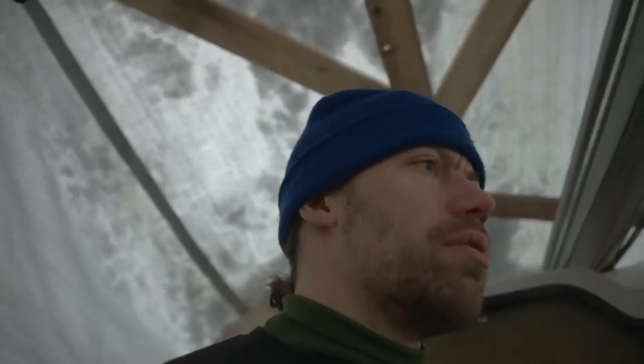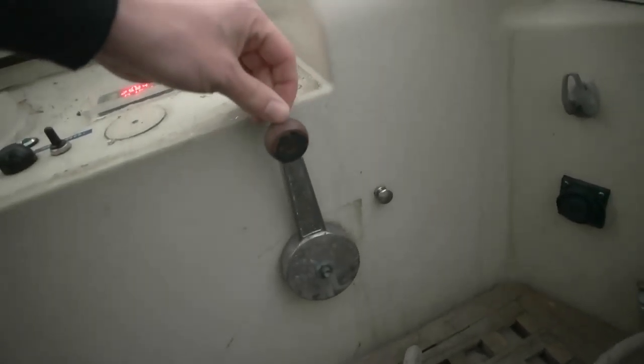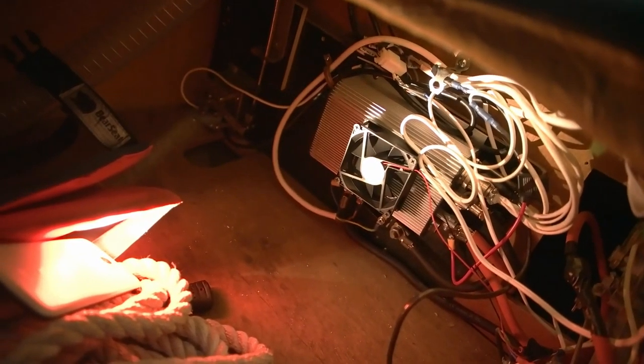In some situations when you are getting close to shore, looking for a place to anchor, where to put the boat, throw the lines — it's not fast enough to switch between forward and reverse. Normally in boats, the middle position is neutral, one way is reverse, the other is forward. But the controller was configured differently, most likely for cars.